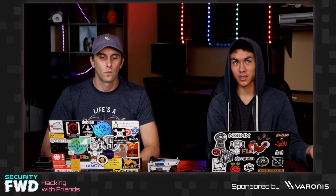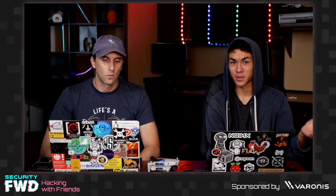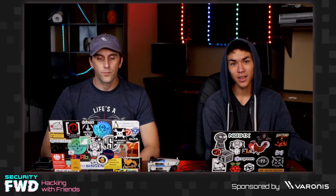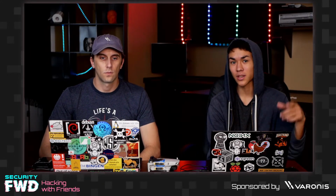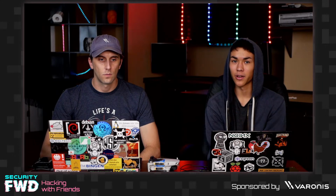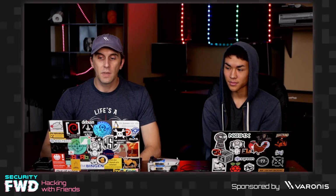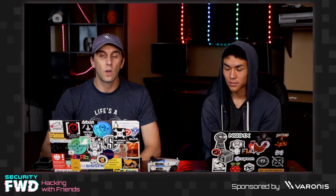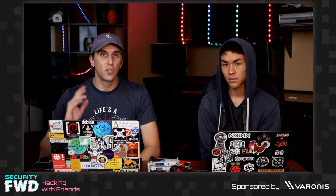So basically what you do is you can drive around or something like that, gather Wi-Fi information from specific locations you drive past, and basically just dump that information on top of a map so you can pinpoint what networks or devices you spotted in a certain area. Exactly. So in this case, we're going to be using the wireless sensor of the D1 Mini, and we are going to be using the GPS sensor to provide the GPS coordinates.